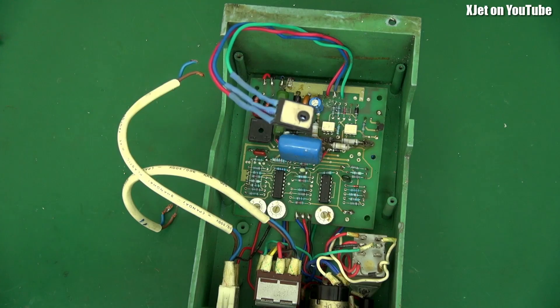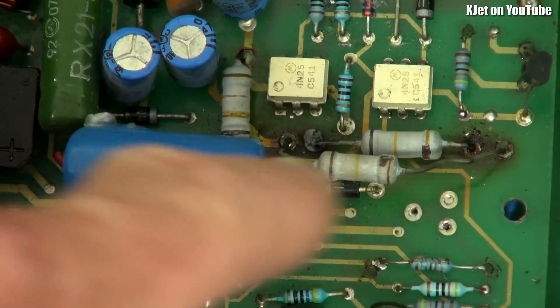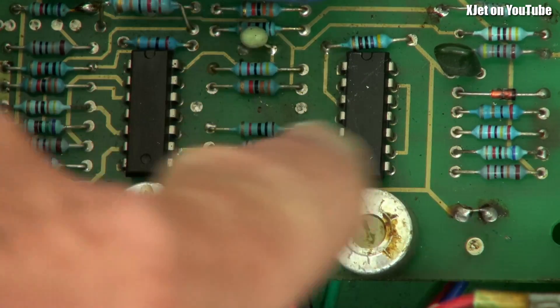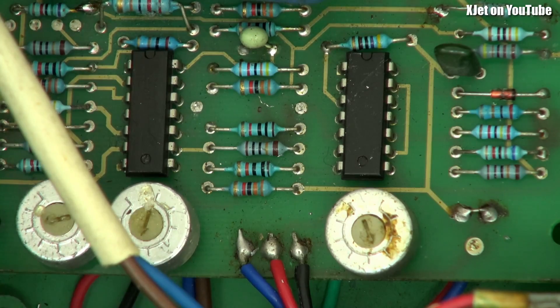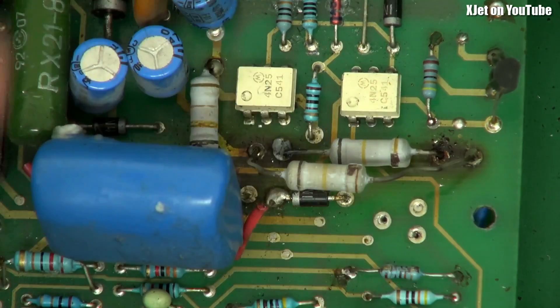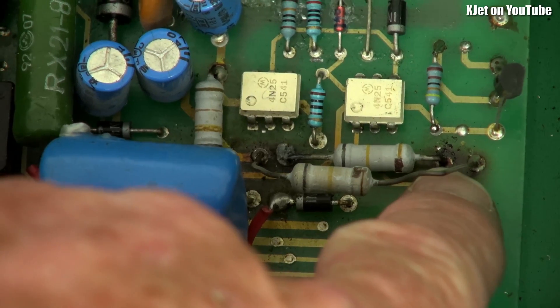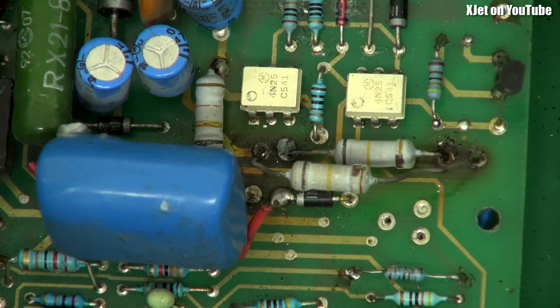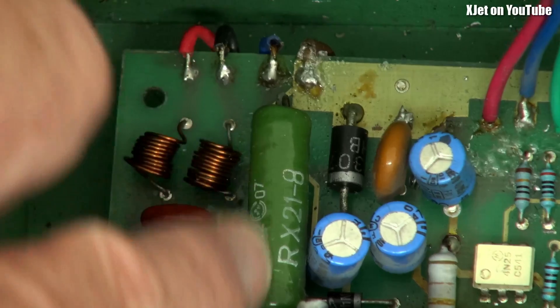Let's zoom in on some of the worst parts. What you can see here is heat damage. This is a standard fiberglass printed circuit board, double-sided through-hole construction. They've used these power resistors here because most of the chips run on five to ten volts, but we've got 150 volts coming out of our rectifier. So they've used resistors just to drop the voltage down, and most of the energy appears as heat. These things get stinking hot, they have conductive copper wire that conducts down to the board, the board gets hot and goes brown — and sometimes it can even carbonize, giving you short circuits. Really bad design. And there's another big powerful resistor here — there are too many big resistors getting too hot on this board.